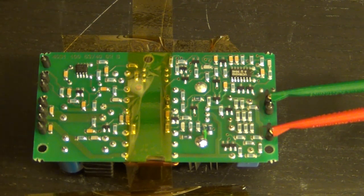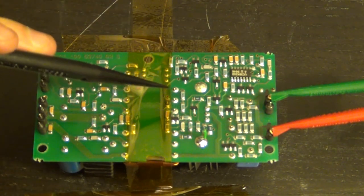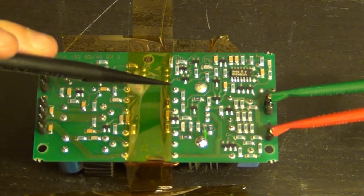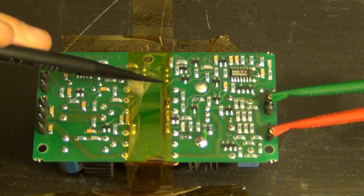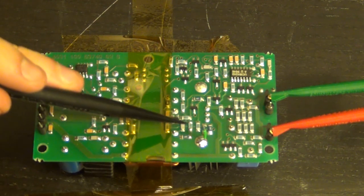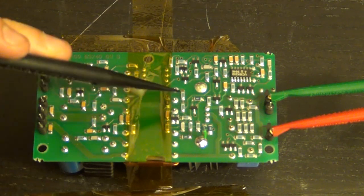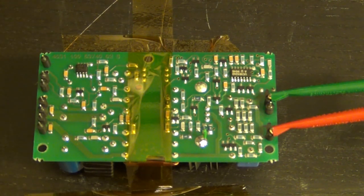So we should be able to go ahead, poke around and see what the voltages are, and then see if we need to bring out the oscilloscope and make sure that the signal that drives the switching transistor is strong. It's obviously present, because otherwise it wouldn't make all that noise, but is it strong? Is it of sufficient amplitude? It is possible that the switching transistor is simply bad and not completely dead, but partially damaged, and then we would replace it. So we would find all that out, hopefully, through some measurements.